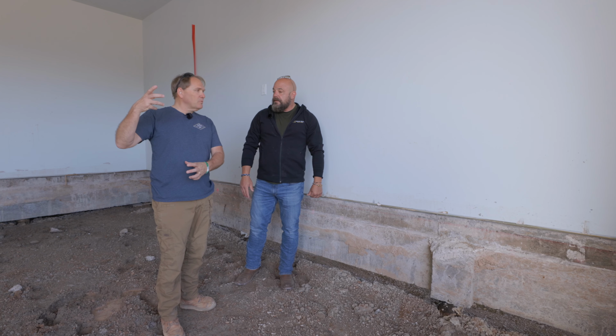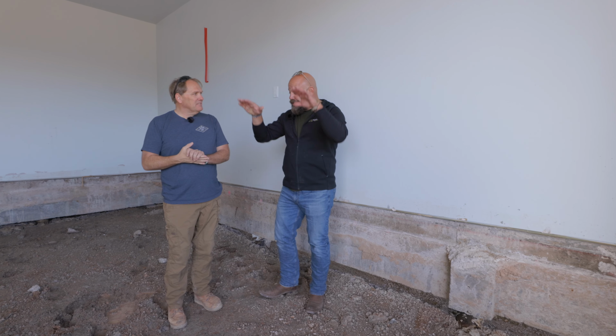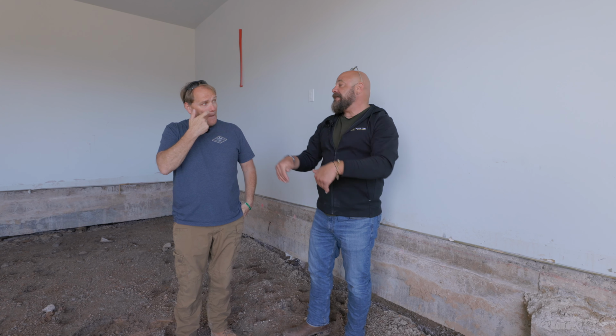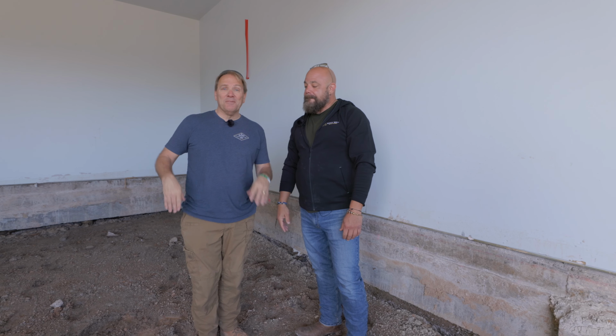And you mentioned you're going to put some additional. How are they going to drill those micropiles inside a garage without much height? We just have to bring the machinery in. I have to actually bring steel plates in here because the machinery is going to sink down in. So we're going to have to put them on steel plates, drill down into there, and have them poured. We hired a new company to come in and take care of that for us. So. I'm sinking in mud right now.